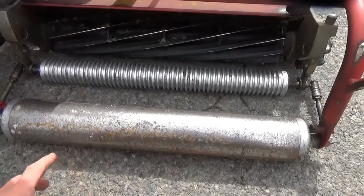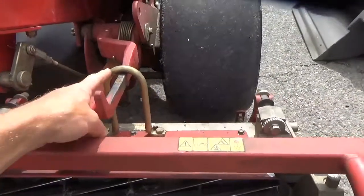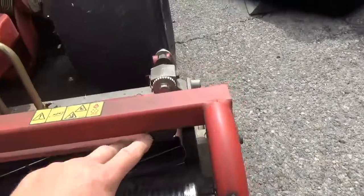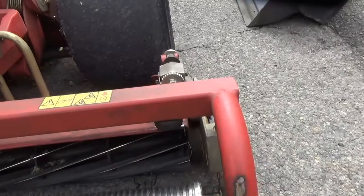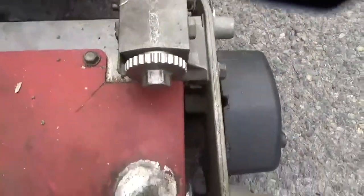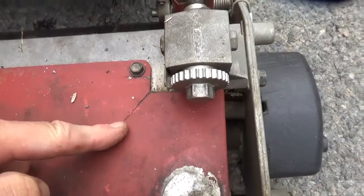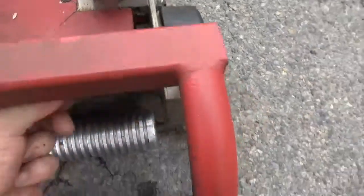When the reel gets lifted by this hook right here, it'll lift the reel up and then the reel has this plate here that'll come up and hit these bumpers and it'll pick up the front roller frame. A couple problems: this flexes and over time you get those cracks. I first didn't know why we got these cracks and I welded them up, but you can see it's just from the flex of lifting over and over and over.